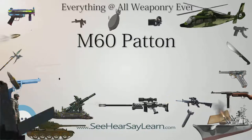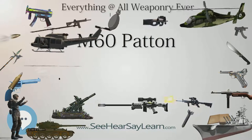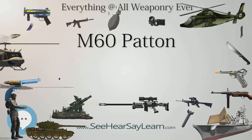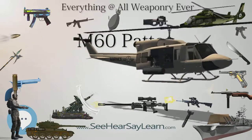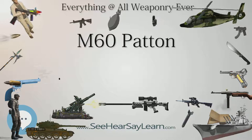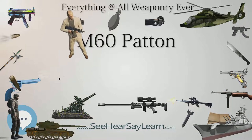Shock absorbers were installed in the first two and last road wheel arms. The uncomfortable wire mesh seats were replaced by padded seats. The brake and accelerator pedal were rearranged for more efficient operation while the steering wheel was replaced by a T-bar steering control. The engine and powertrain were upgraded with the Continental AVDS-1790-2A and CD850-6A, lowering fuel consumption and smoke emissions. Combination IR periscopes were introduced: the M32 for the gunner and the M36 for the commander.